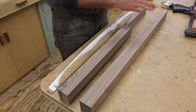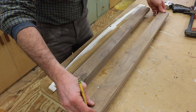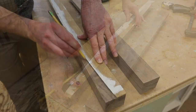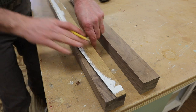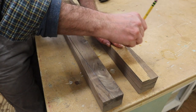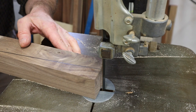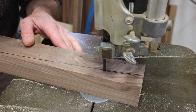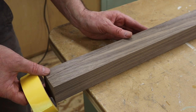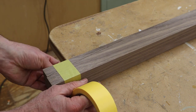It's hard to see the pencil in walnut, but I've marked the front legs — the front right and front left. You just want to keep that in mind when you're making this cut. I'll put the pattern on top of the left leg and trace it, then flip the pattern and trace it on the right leg. I'm going to take the cut-off and tape it to the leg, and that will allow me to make the same cut on the front of the leg.